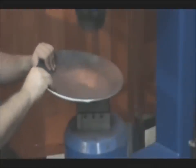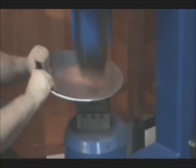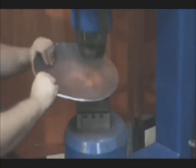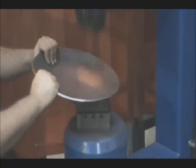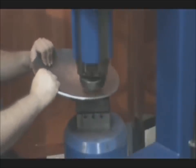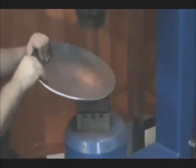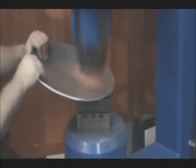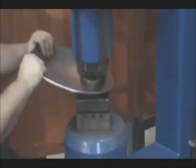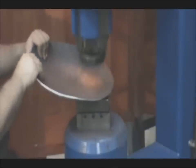Okay. So you can see I've made several passes here. A typical bowl might take anywhere from 7 to upwards of 20 or 30 passes, depending on how smooth you want to get it. And don't worry about smoothness much until the very end. The main thing you want to pay attention to is the balance, making sure that you're not coming out of your sphere.